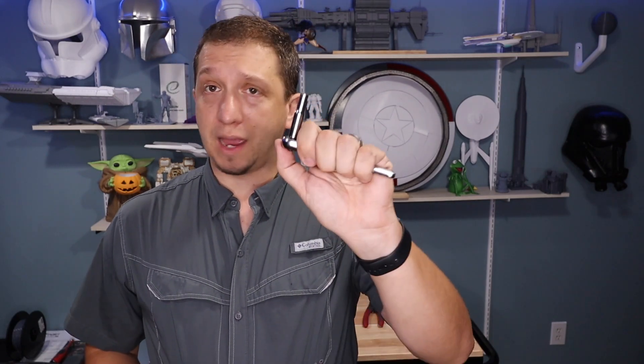It just allows me to work around and bring that nozzle in and out without burning myself — just a long socket on a small socket wrench. Then a lot of times I'll pull the filament, make sure the end of it's clean, put in a new nozzle and back to the races. If that doesn't work, there's usually a clog up in the Bowden tube, which means I've got to undo the Bowden tube with a wrench, pull the nozzle, and then cut the Bowden tube with a straight cutter — not side cutters, which won't give you a straight cut.